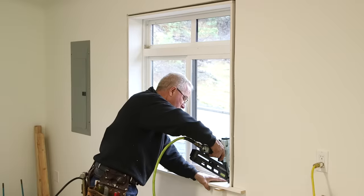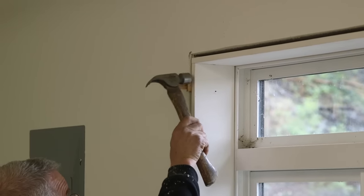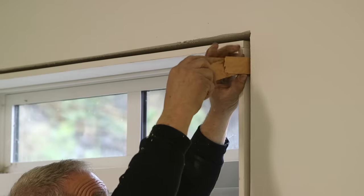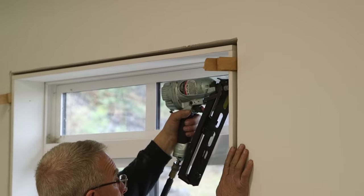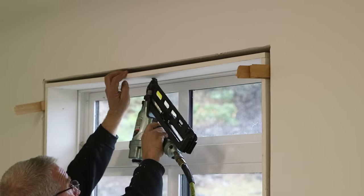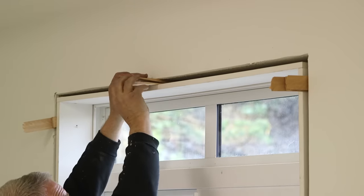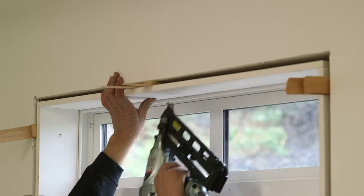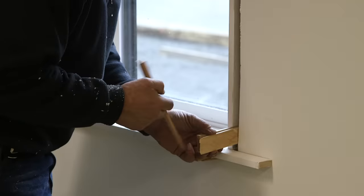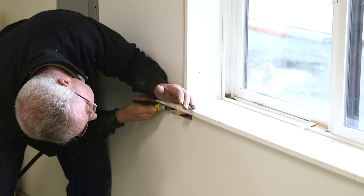A shim is an application of an inclined plane, and it's an ancient, ancient tool. Shims have probably been around just about as long as a string line, and they are just about as useful. Factory-made shims come in a variety of wood species depending on their size and intended use. Door shims like these are usually soft wood and fairly brittle, because a big part of setting doors and windows is being able to easily break them off at different times. The thing about shims is that they can apply an amazing amount of force in a perfectly controllable way, and then hold that load perfectly still for as long as you need.